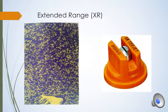The first nozzle is an extended range nozzle. This provides the smallest droplet size and the most coverage. A negative is that there is a lot of drift potential. This would generally be used for contact herbicides, fungicides, and foliar fertilizers.